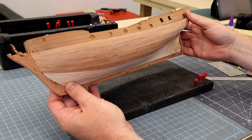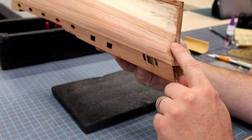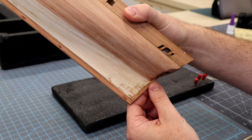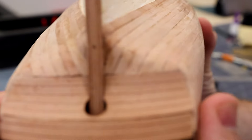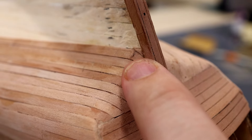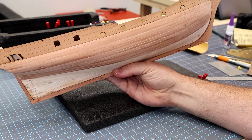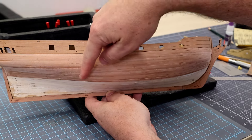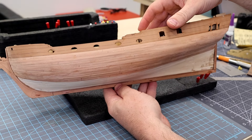We've gotten to the point I was working toward in the last video - your timbers have basically got to the point where they're just going to be running flush into our stern post back here. There's a little filler you've got to put in there. This side turned out a little bit better; on the other side I ended up having to put in a tiny little filler piece. None of this is sanded or cleaned up yet. The lines here are working out pretty well - comes down nice and easy, nice curve, comes back up. There's a little bit of a dip but that's okay.